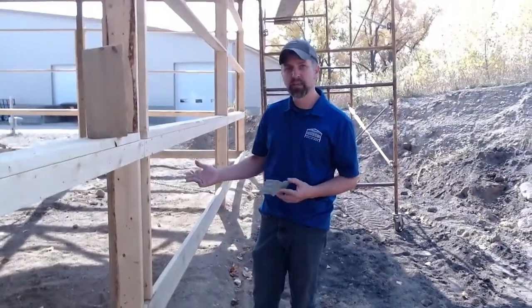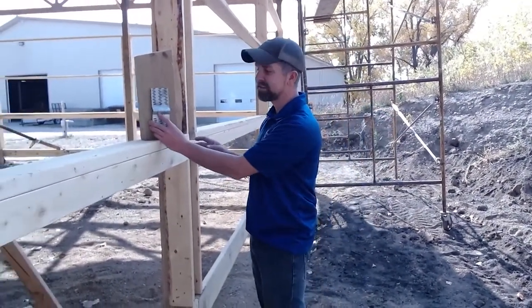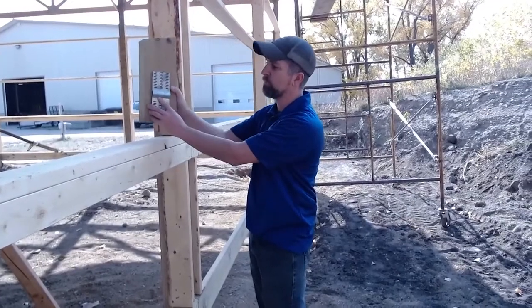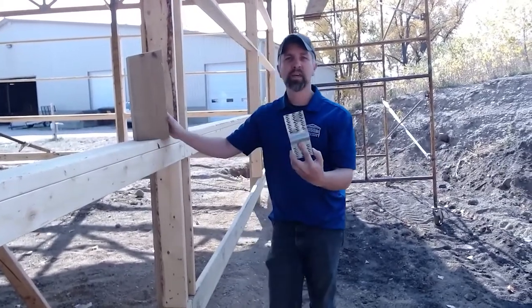The column is going to typically be held up eight inches so that it's fully encased, and once this is attached on there firmly with concrete totally encasing it, that concrete can't move without this entire column attached to it. So that's an uplift plate.